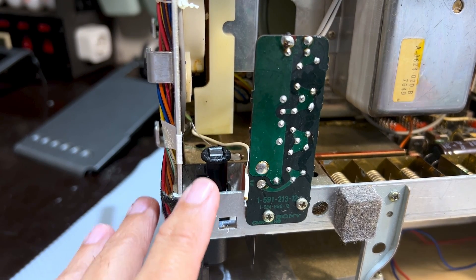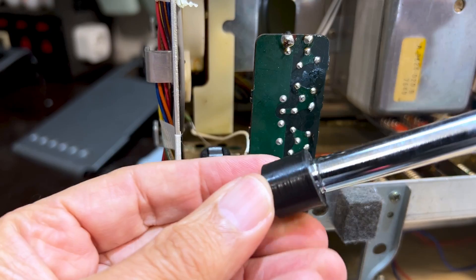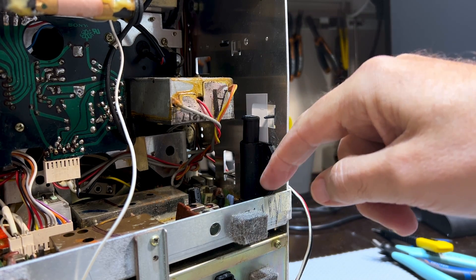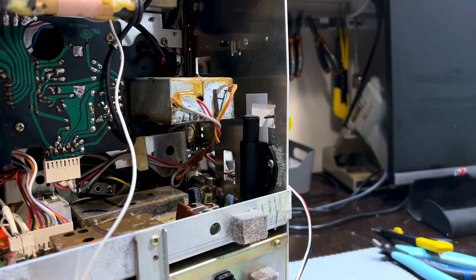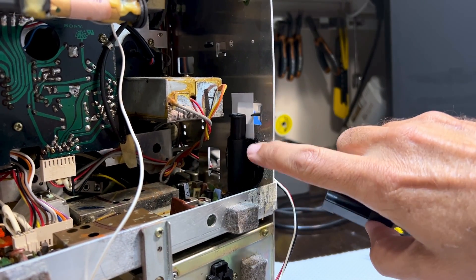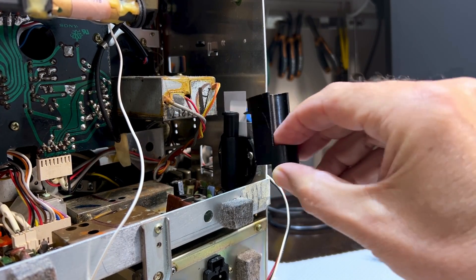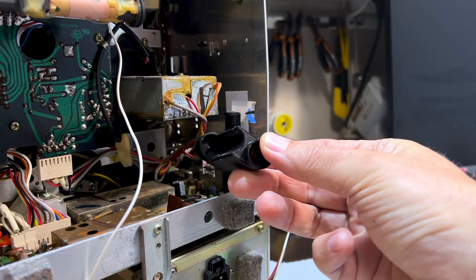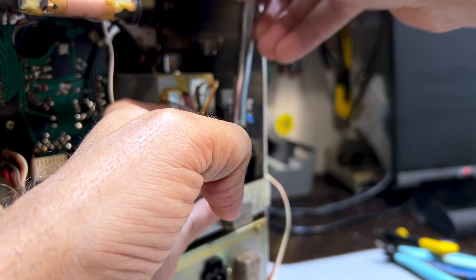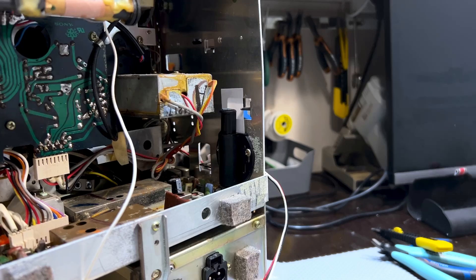This is one side. The other side was completely different. If you recall, the only thing I had here was this slot — the antenna fits into it like that, and then this goes onto there. On this side I don't have the space, so I had to create a shifted stand — something that would allow me to fit the latch switch on there, just made two holes and screwed them in. I had to plan the sizing and spacing very carefully, and design this piece. It shifts the antenna back from the axis of that plunger, but it basically does exactly the same thing.